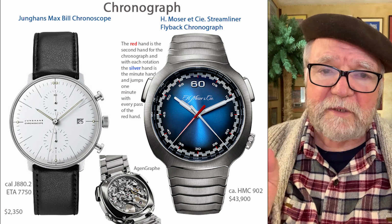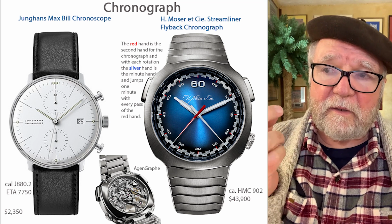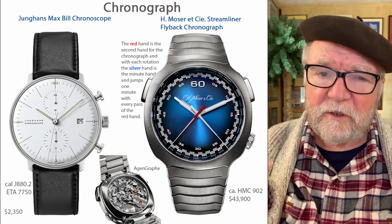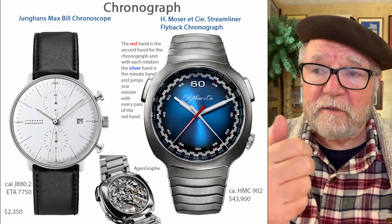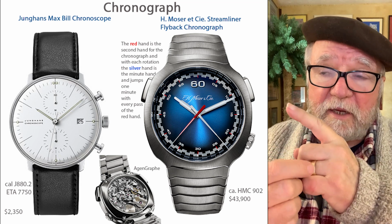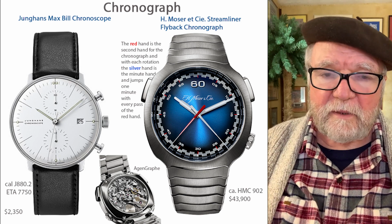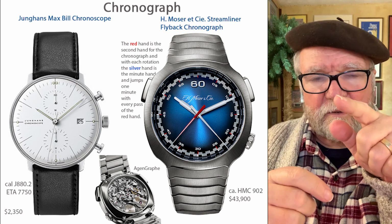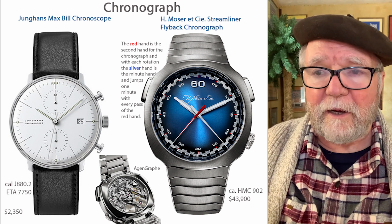What he did, he figured out a much simpler way. Rather than having a lot of subdials all over the place, he uses the main dials. Now, once the chronograph is started, he's got two hands. There's a red one and sort of a silver-white one. The red one starts timing the seconds, like on a stopwatch. You start it, and the whole thing goes around. The minutes are counted as the chronograph seconds go around; as soon as it passes the top, the minute hand goes one. So let's say you time something and you look at the final positions of everything, because they both start at the top like this, and then the chronograph second hand goes around and kicks the other one over. But look how very clean that dial is.